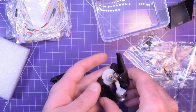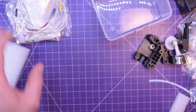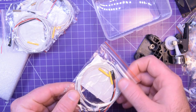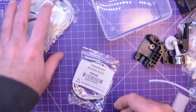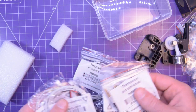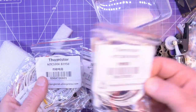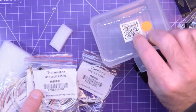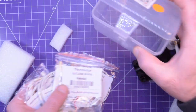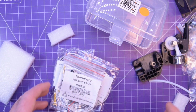I need to still send the V1 back to Amazon, but I'm glad I got this one instead. I think this one will be a lot better quality — it's fairly well made. This is like fiber reinforced plastic, really nicely molded. There's a tensioner arm here which controls the second gear. The gear meshing seems a little bit better. I also got thermistors here — these are able to go almost 300 degrees Celsius, and I got a five pack. They were like a dollar a piece, so that's pretty good. All this was ordered from Triangle Labs on AliExpress.